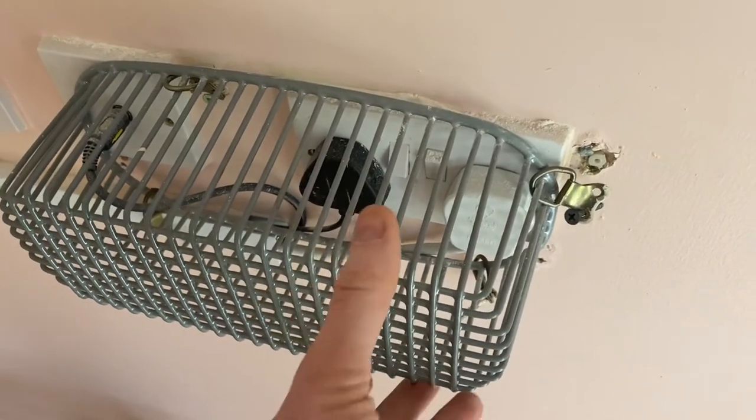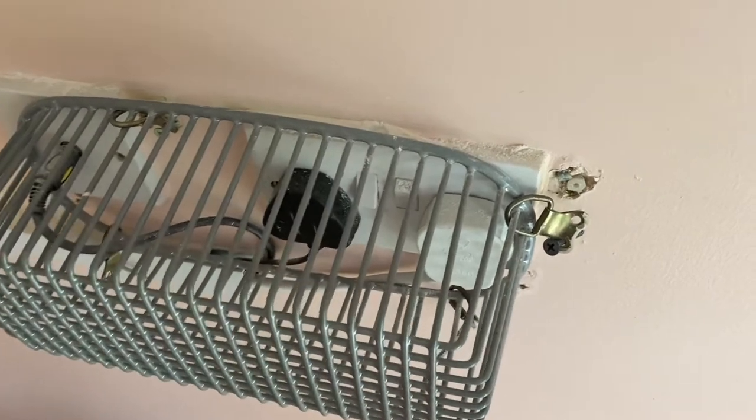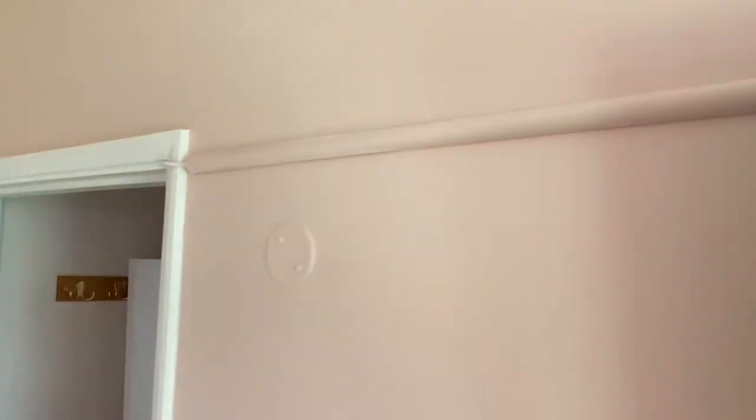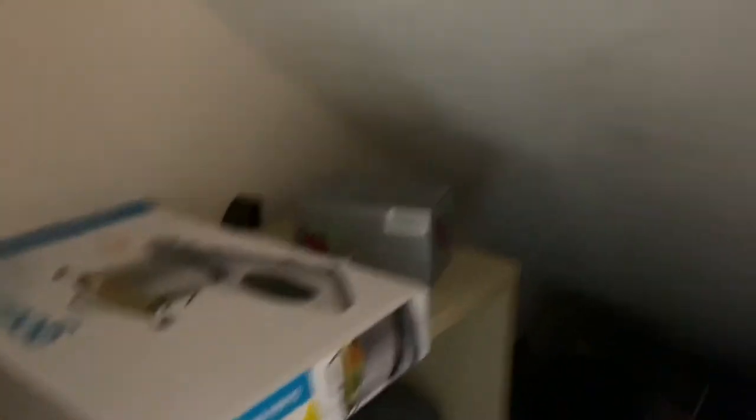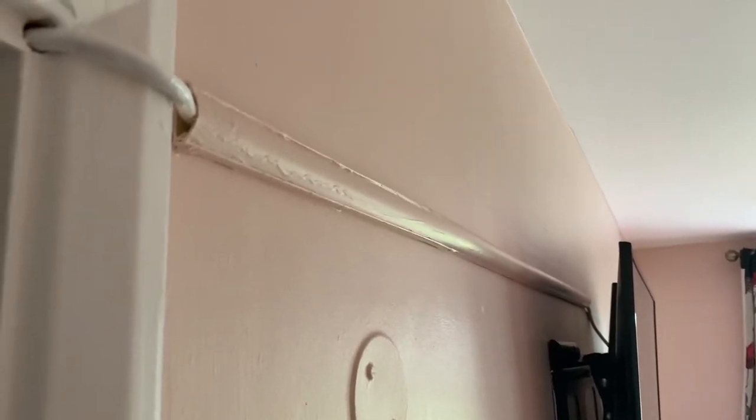So we're in our care home this morning. They've caged over the plugs for a bit of extra safety — I've never seen that before. We've taken the screws off to test the TV up here. You can also see there's an extension lead that runs all the way up the trunk, in here, and down the back of the fridge, powering this fridge freezer. They've done a very good job of it, but it makes it a bit of a nightmare to do a PAT test and difficult to do a visual check.